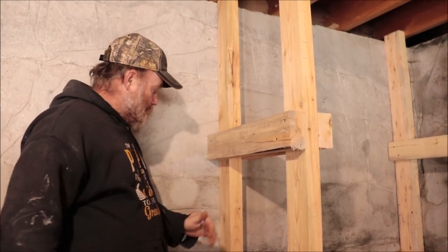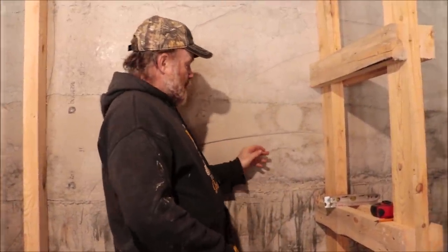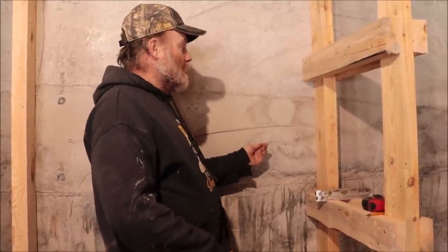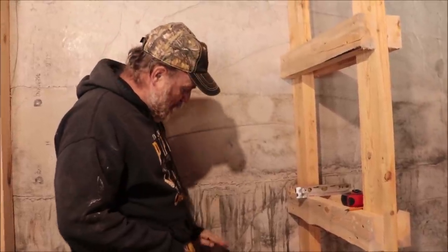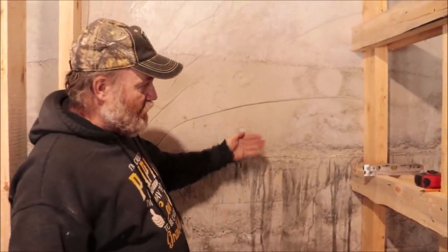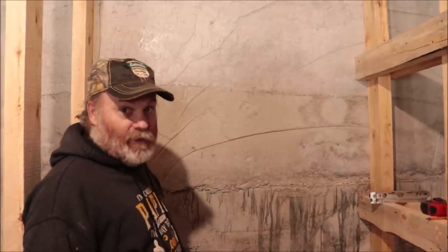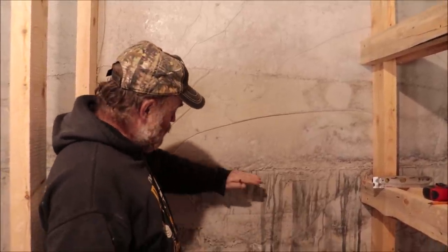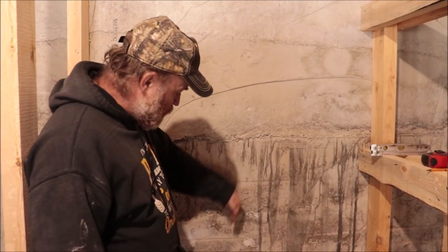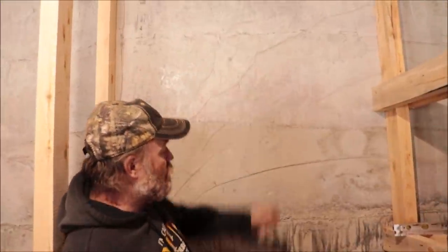Now I think most of you know why the walls look so rough in here. Heather and I, like a lot of you folks know this, but Heather and I poured this ourselves with a 5-gallon pail. We mixed the concrete in a mixer, but we carried the concrete in a 5-gallon pail, so we made our forms 4 feet high, and we stapled plastic on the OSB inside, and where the plastic went wrinkly, that's what happened. But we wanted to be able to use the OSB later, so that's why we stapled plastic on it. So we did a 4-foot lift, we did a 4-foot section, and then once that was done, we took those forms off, we built just a studded wall with no sheathing, and then we set that section up on top and did the other 4 foot in a separate pour.